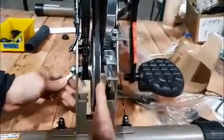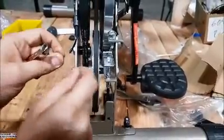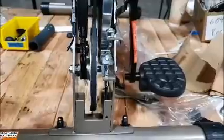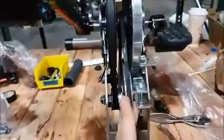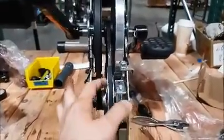The whole point is to get this aligned and centered to prevent the parts from wiggling against each other and making this aluminum pulley rattle. There's a second bolt on this side that you can also tighten or loosen. You want to make sure that the amount of threads sticking out here and on the other side is about the same, because that means the pulley will be mostly aligned and will be pulling the belt evenly.